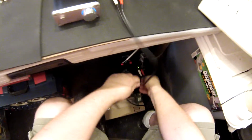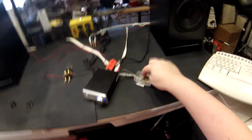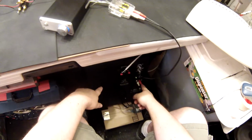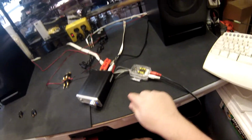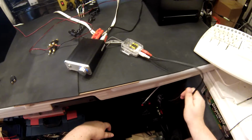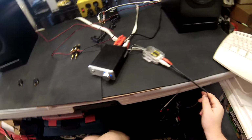You could also, and here's the thing, use really short RCA cables and just run long wire lengths to this box. This box doesn't have to live on your desk. This box could get velcroed to the subwoofer. You could use little 1 foot lengths, and then just run speaker wire, because speaker wire is not going to take any interference. Well, it can. You pretty much just run it through a microwave. But line levels like this, if you have your sub far, far away, more than 15 feet, you may be better off just running speaker lines to it.